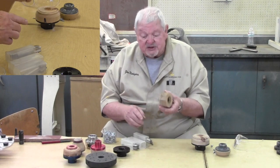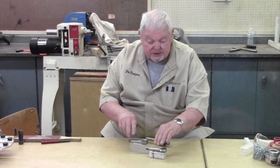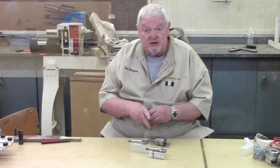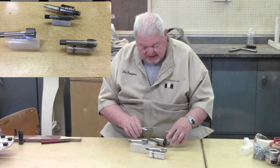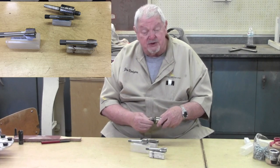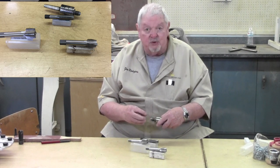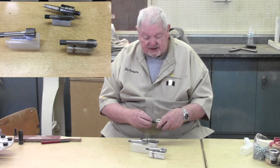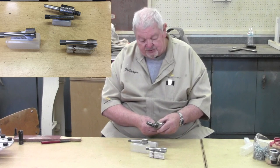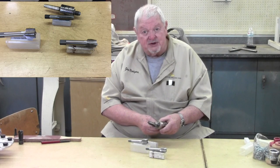For little tiny projects, I really like these wooden faceplates — they're much lighter. Beale also makes a third tap, a three-quarter inch, which is designed to screw projects onto the end of this One-Way live center system. So if you want to make your own adapter or fitting, that three-quarter tap allows you to fit onto the One-Way, Jet, and Laguna live centers.